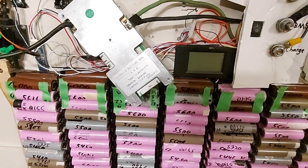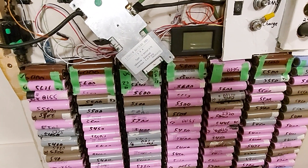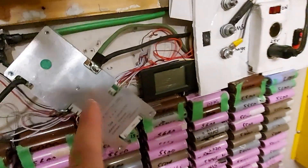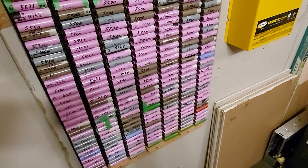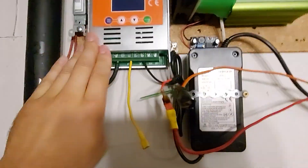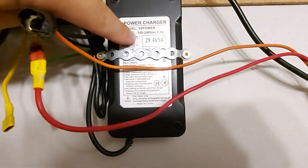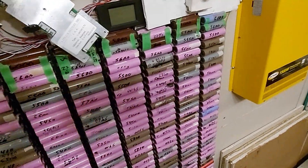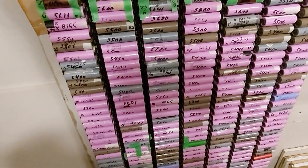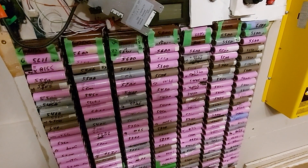This thing failed — the balancing system on it. Maybe I had the settings too high. What triggered the catastrophic failure was doing an updated load test, running my entire gaming computer off this Powerwall. It did quite well, then I recharged it using the boost converter, not my solar charge controller. I think it just kept trying to charge the wall, and because of the cold solder joints, everything was 0.1 to 0.2 volts out of whack — just too much imbalance for this BMS to handle.